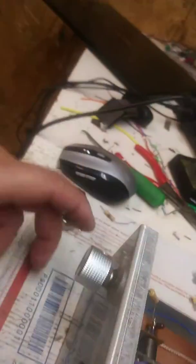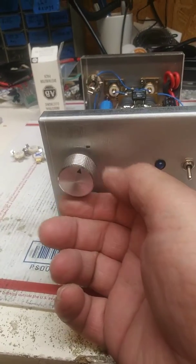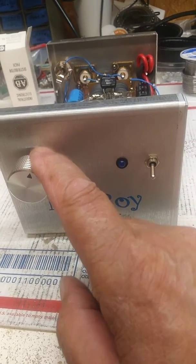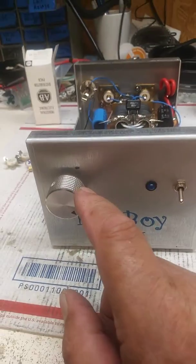There is your 5 watt 100 ohm, which is considerably bigger than this. You've been turning the thing back up to here — that's a long ways. You shouldn't have to. If you have to turn it back like that, your radio is dead-keying too high. You always want to leave this wide open. It's a point for failure anyway.